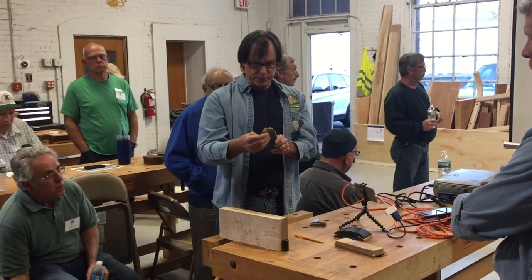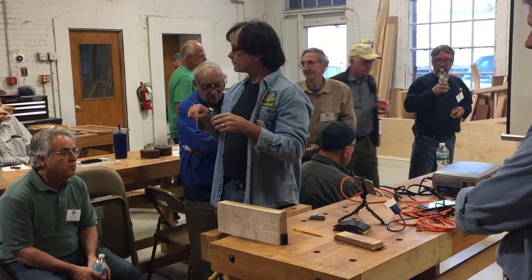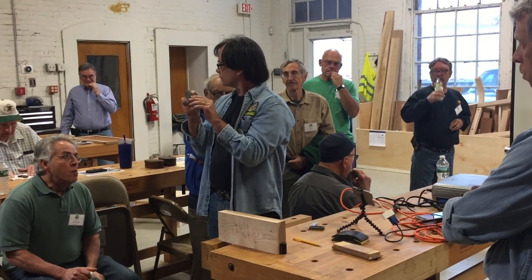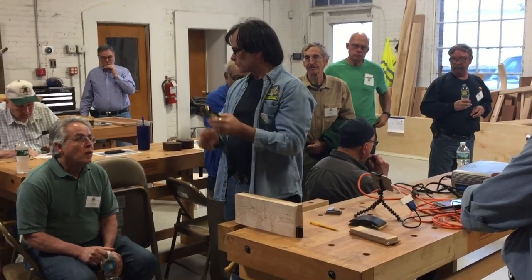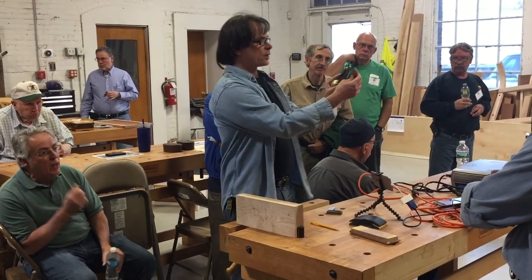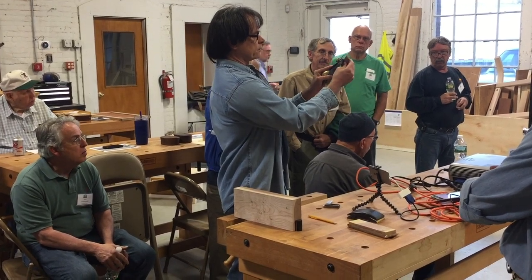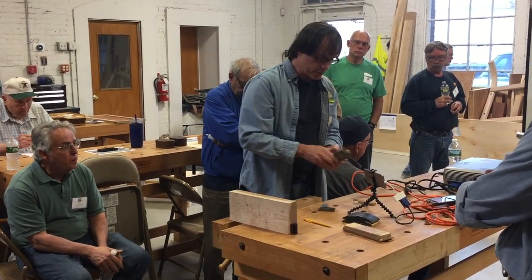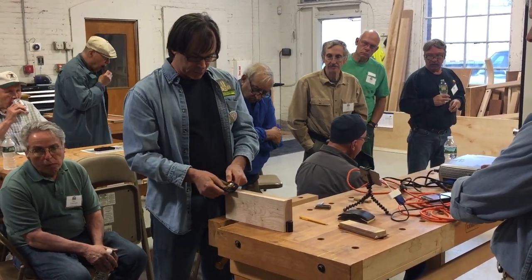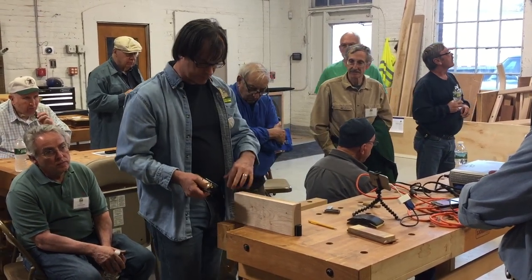What I've done here is similar to what you might do if you have a spokeshave. Often people will set their blade a little bit askew instead of perfectly parallel, so that you have a heavy cut on one side and a very light cut on the other side. I've set it up so it's very light — almost non-existent on the right-hand side — and pretty heavy on the left-hand side. That way I can hog off material pretty quickly at first, and then work to the other side of the plane blade to do the finer strokes at the end.